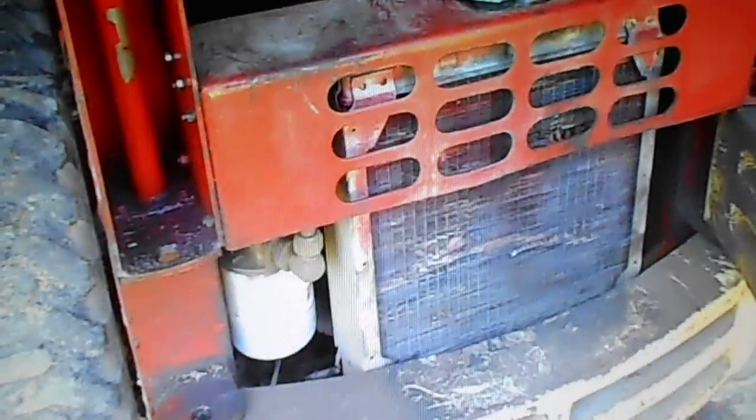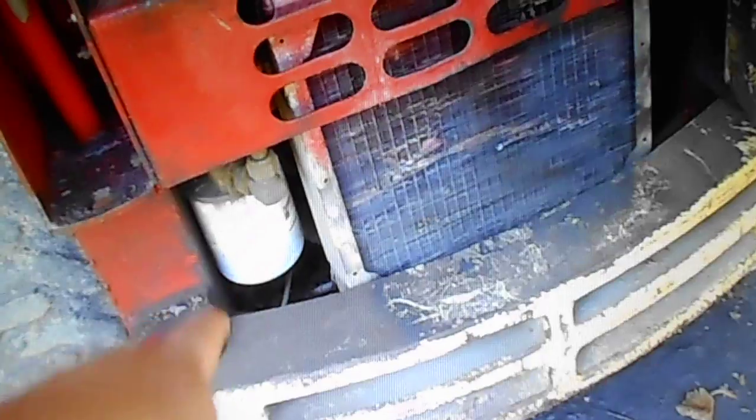The engine oil filter, that's a little bit of a bugger to get to on these, because you've got to take the air hose off the air cleaner going down so you can open that side panel, or if you don't have the top like I made for this, you can reach down and it's right below the carburetor, which you probably can't see, but it's down in there. These are not the easiest things to work on, but that's where everything's at. But that's your oil fill and dipstick, and that's where your hydraulic filter is. Of course, the engine oil filter's over there.